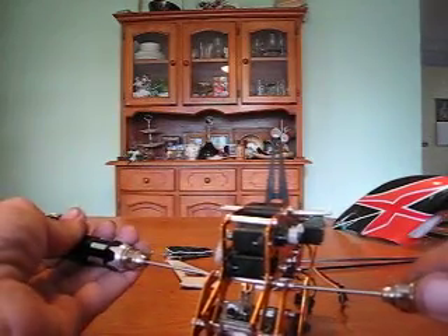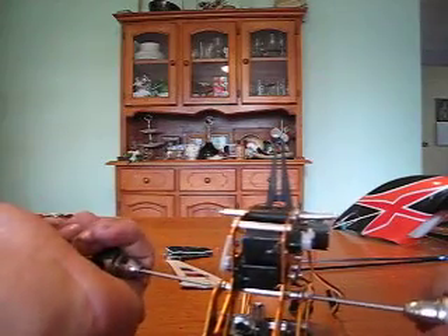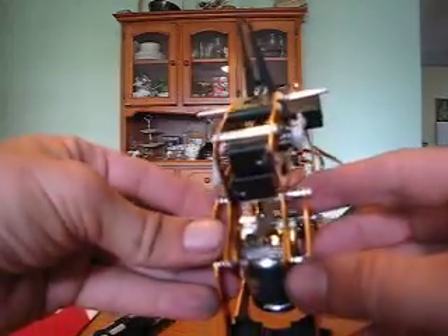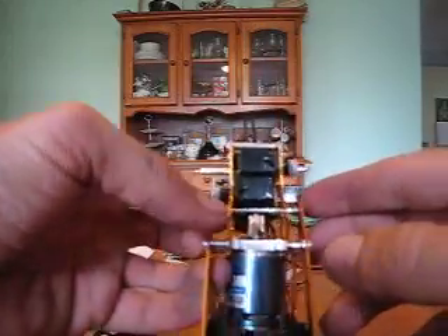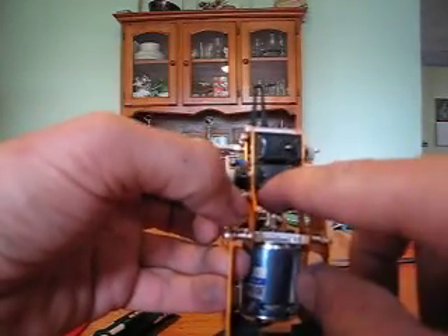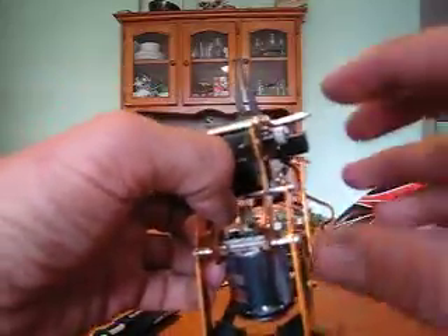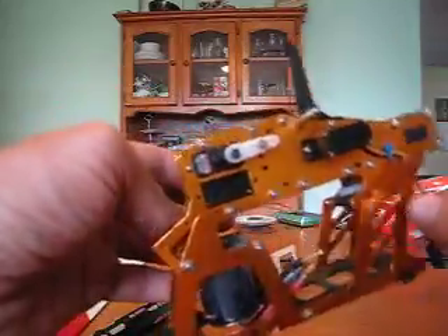Make sure you've got Loctite on them. I do my normal trick — one screw in, one screw in with Loctite, and take the first one out again. So you've tensioned them up. The reason you need two drivers is if you're trying to only tension one side, what it would do is only spin the center bit. It won't actually put tension on it, and the other side will just spin nice and free. So you need the two drivers to tension it up together at the same time.